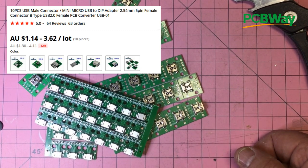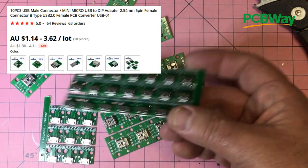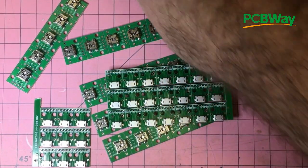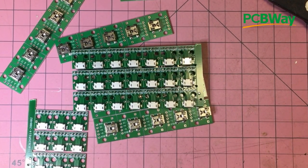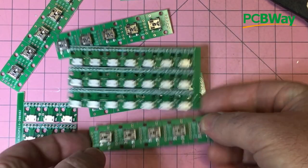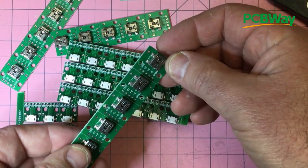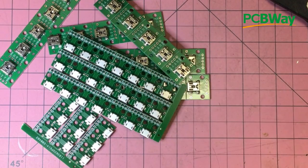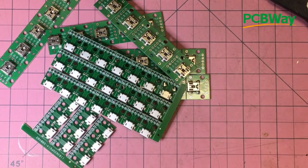I've had a lot of trouble with the SMD USB connector on the Padauk programmer, so I thought maybe I could break it out to something a little bit more durable — even to one of these old mini USBs as opposed to micro USBs. The other thing is I've got quite a few projects running off batteries, like a clock project, and I thought let's convert a couple to five-volt power via some wall warts and bring the power in like this. I've also made up a couple of these to give power to breadboards, with some capacitors soldered on for smoothing — pretty handy for all sorts of things.